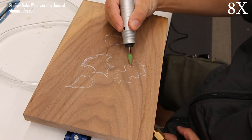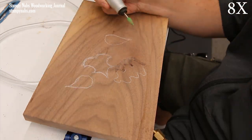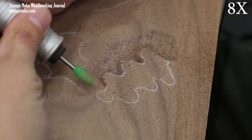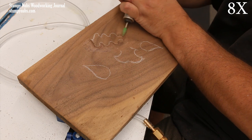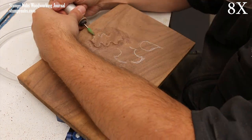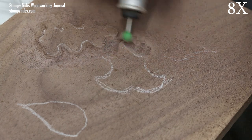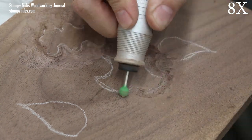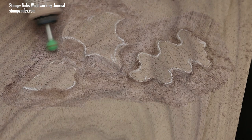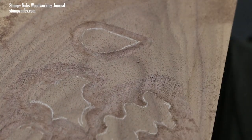The first step is to outline the shapes and begin removing some of the wood around them. A pointed burr of some sort is a good choice here — use the tip to get into tight spaces while you use the rounded side to abrade away the open areas. You don't want to just dig a trough around your leaf; you also want to slope it outward away from the lines. Don't worry about getting everything smooth and perfect at this stage — we are just roughing things out. Since you're most likely wearing a dust mask, you can't just blow the excess dust from the carving, so I stop every minute or so and use a paint brush to clean the surface.